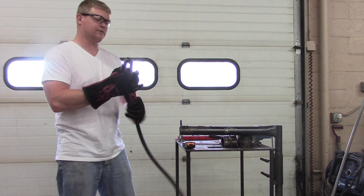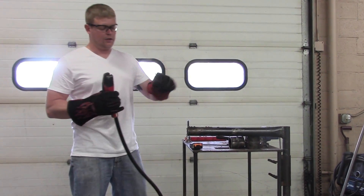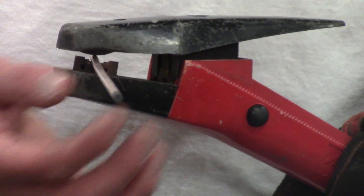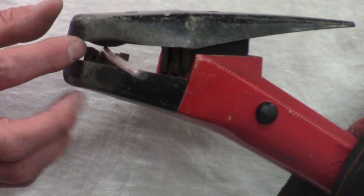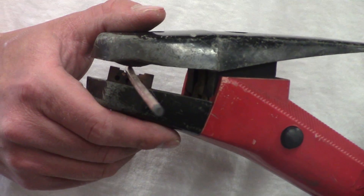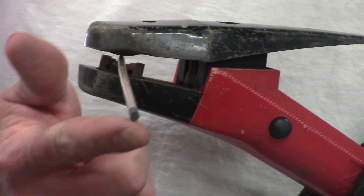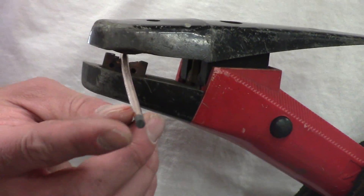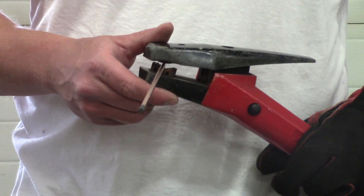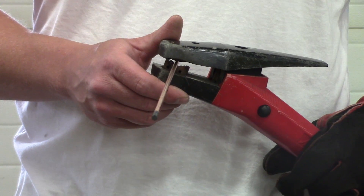This is going to be your gun here, and it looks kind of like a stick welding electrode. You put it in here. You've got this carbon rod that goes in these two little holes. What those two little holes do is — you put a compressed air source to the back end of this and it shoots air down this rod. As you touch it to the material, it's going to blow the material away. Really useful in taking lots of metal out, removing fillet welds, things like that.